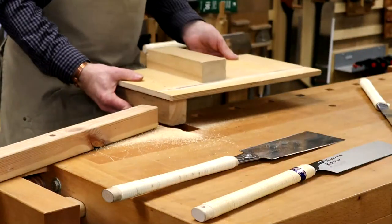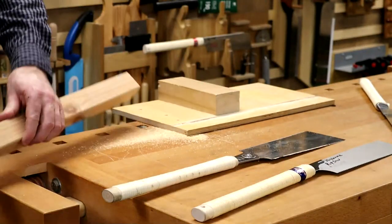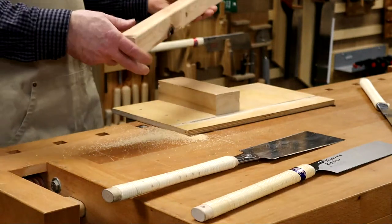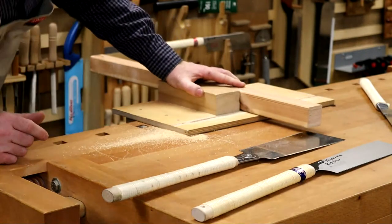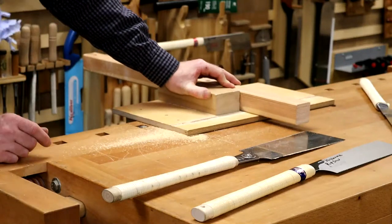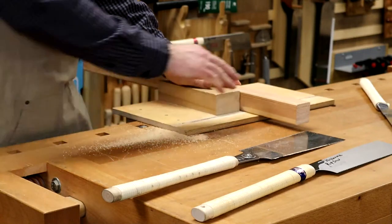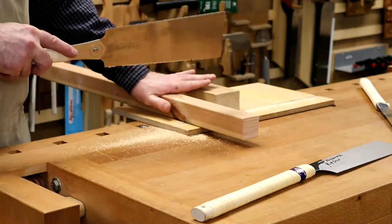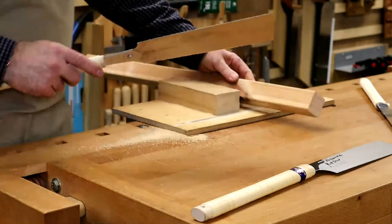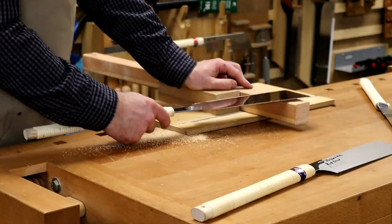We're using a pine. Just going to reach for something I'm going to need now. Other thing you need to think about to get into this, you might want a bench hook. If you're going to have a bench hook for this, you'll need it the opposite way round to what we're used to, which would be here, because your work's going to drift away. Go up to there. I can turn the saw over.